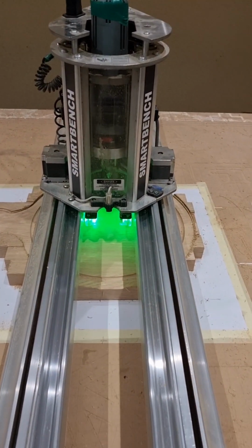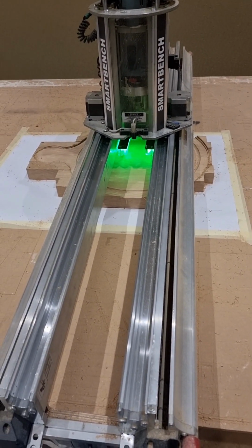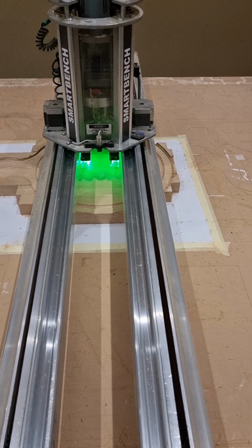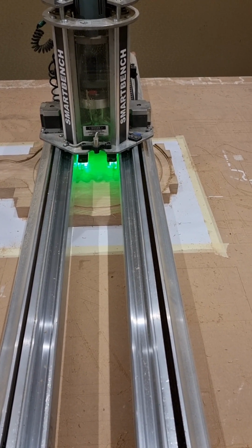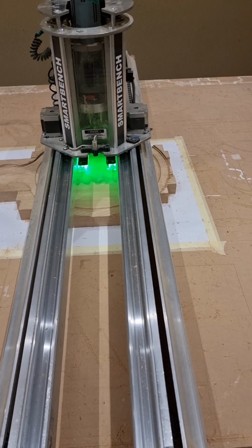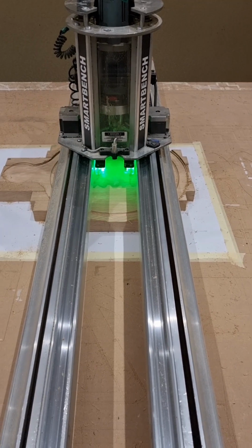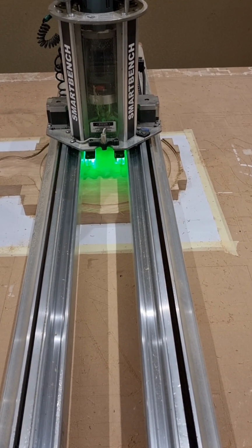Okay, now I'm going to do the V-carve of Buon Appetito. And this is an actual client's own handwriting, so she was able to send me just a picture of what she'd written, and then I was able to use it in the VCarve Vectric program. I was able to copy it using the bitmap trace, and then scale it to the size that's going to fit the board. So it should look kind of cool, and it's really personal, because obviously it's the person's own handwriting, so you can't get more personal than that, really.